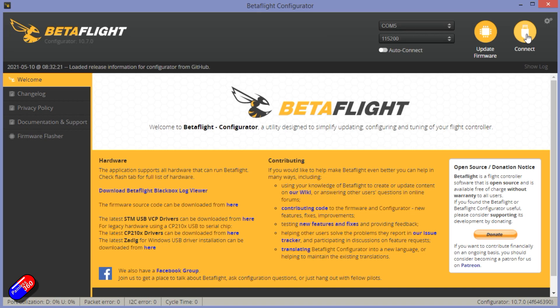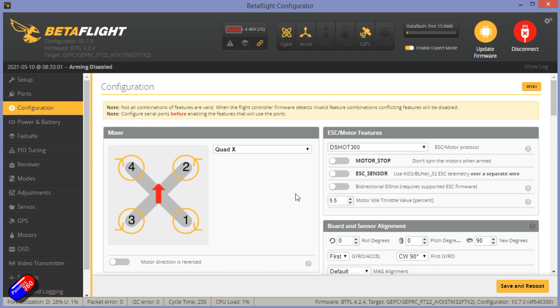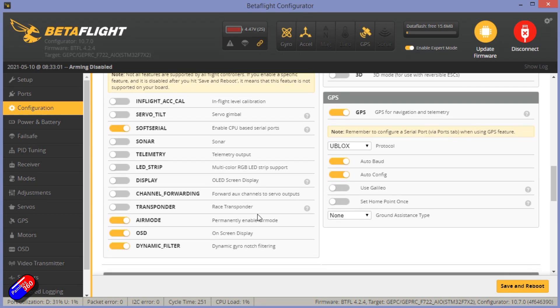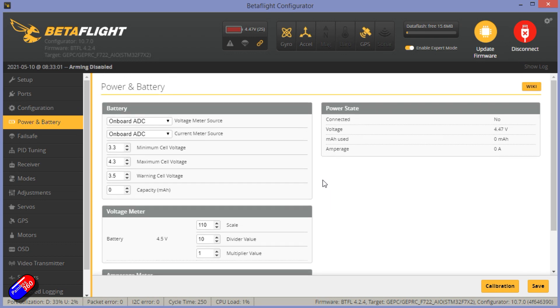With that done, let's plug it into Betaflight. The dump and diff files are available via the link in the description. In expert mode you can see the data flash shows it has been armed. Ports show GPS is set up, and MSP for telemetry back to the DJI system is configured. Configuration shows standard prop direction, DSHOT 300, 8K gyro, 4K PID loop frequency — this is an F7 processor just ticking over at that level. SBUS by default for input, air mode is on all the time, and the beeper is set up for the loud external buzzer at the back.